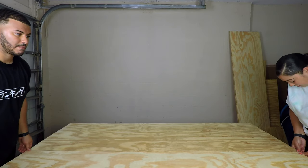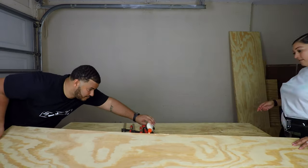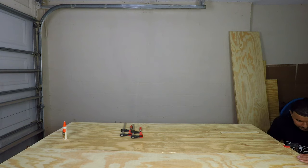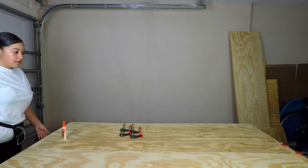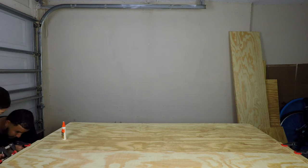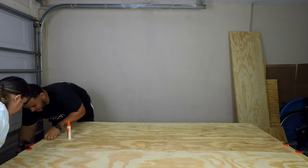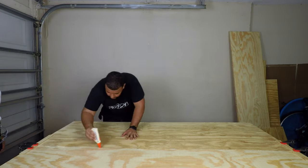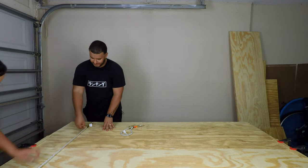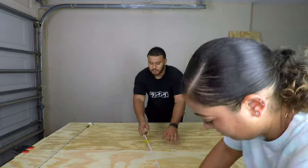All of the measurements and materials we use to make our mirror will be listed in the description box below. At our hardware store they didn't have a five by seven piece of ply, so we used two four by eight pieces instead and had someone at the store help cut them down to size. Now you're watching us connect those two back pieces together — we used wood glue down the center and bar clamps to hold them in place, and we also added bungee cords we found around the house to push the two pieces together in the center.